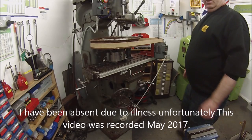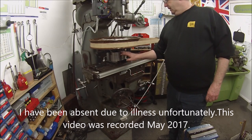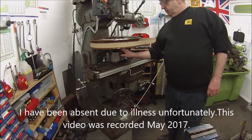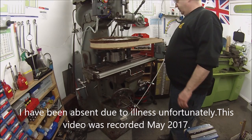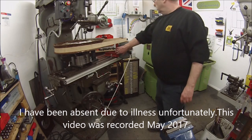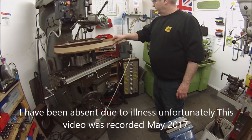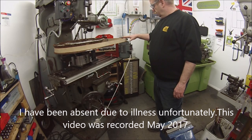What I've got here is a similar sort of setup. I've got the lathe chuck on some parallels, clamped down there, and I've got the wheel spindle mounted in the chuck so we're nice and rigid. Over as you can see from the belt, I've made some brackets up and mounted a motor on the other end of the milling machine table, and we've got a flat belt drive.